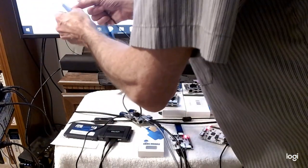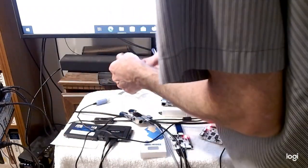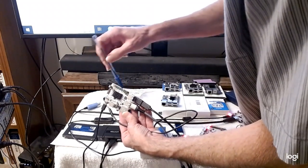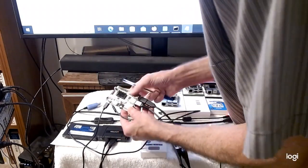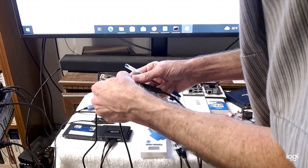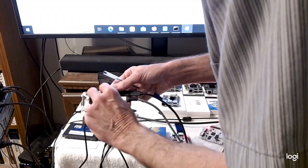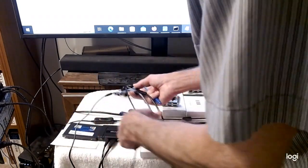Okay, and hook that to our, I usually hook up my wires to the UART. The UART is right here on the Solitude, kind of in back of the USB port right there. And it's color coded too, so black goes to black, then white goes to transmit, and green goes to receive. So I've got my UART hooked up.